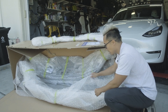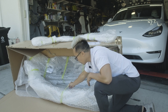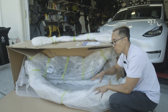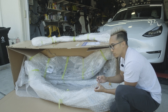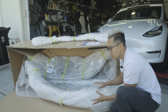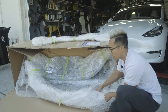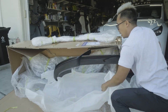What's special about this kit is that it is made from pre-preg dry carbon fiber. Pre-preg dry carbon is made differently than traditional wet carbon fiber — with wet carbon you have the carbon fiber cloth and wet resin poured on top, whereas with pre-preg the resin is already in the carbon. It's then cured in an autoclave, which is a high-pressure, high-heat oven, leaving a dry finish with no excess resin.